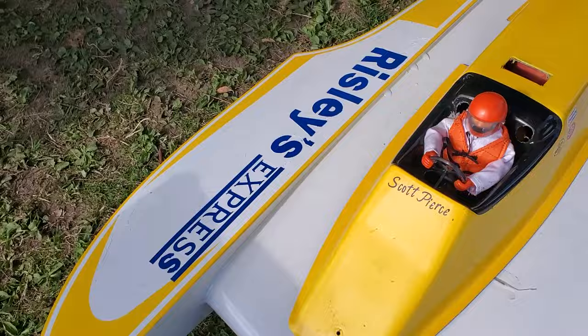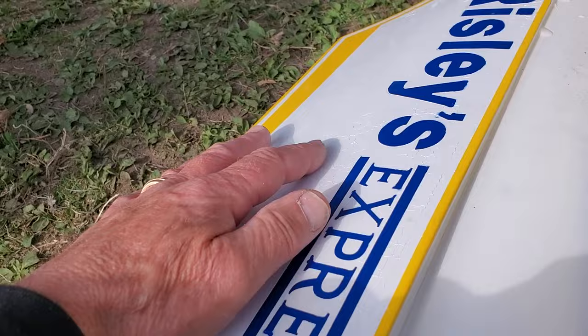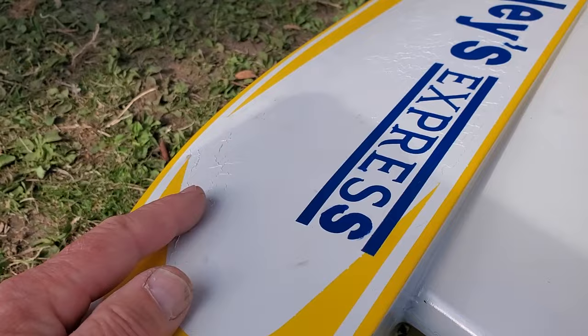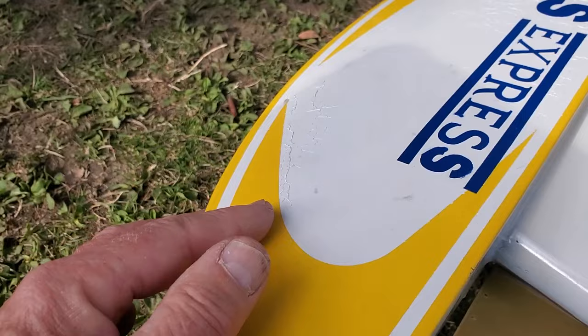So yesterday, and maybe I included it, maybe I'm including that now, maybe not, but yesterday we talked about how this damage occurred here, and I thought that it was on account of something being underneath the paint, but as I thought about it more, I remember having this happen. Can you see that? A little bit of damage. It's a reaction between one layer to the next layer, like incompatible styles of paint, or maybe even shooting the next layer way too soon.